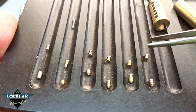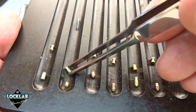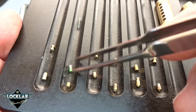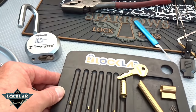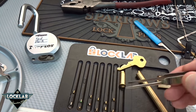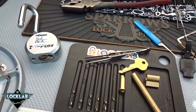So we got a total of four spools, one kinda serrated, and I'm going to call them standard in terms of picking. The T-pin probably reacted a lot like a standard, and then these two narrowed-top key pins. There you go, Ted — thank you for the lock, I appreciate it. It gave me a lot more trouble than I would have expected from a few spools and a couple of homemade pins, especially with no threaded bible and no threaded core. Very surprising in terms of resistance.